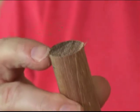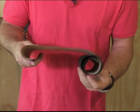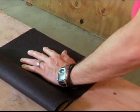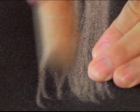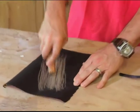Now we're going to sand down these edges and get rid of these sharp burrs. A quick tip with sandpaper — I've got this big roll, but you don't need the whole lot. Put it on a sharp corner and tear off the exact size piece you need. As you're sanding the edge, especially on a round piece of dowel like this, make sure you twist it — it allows a nice, even, round finish.